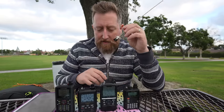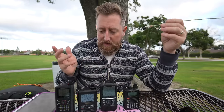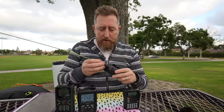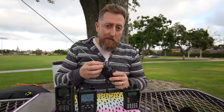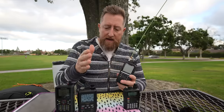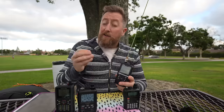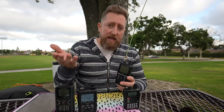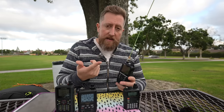We could just end it there, but expensive radios should have more features than that, right? What makes them so much more compelling? Obviously they do more things like D-star, band scope — both of them are GPS enabled. But they actually do more than that. In the case of both these radios, they have either gain that can be applied at the mic level for mic input gain, or some kind of equalizer control on transmit. This does change the output volume of the radio, so it's actually pretty interesting to hear it on the receive side.